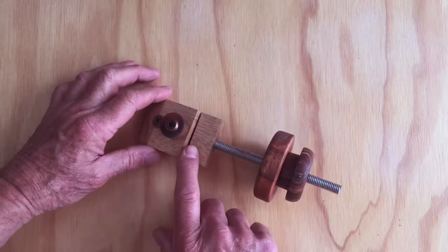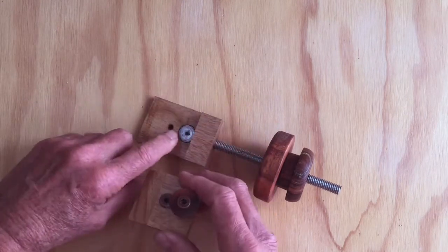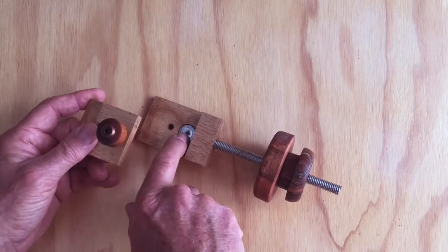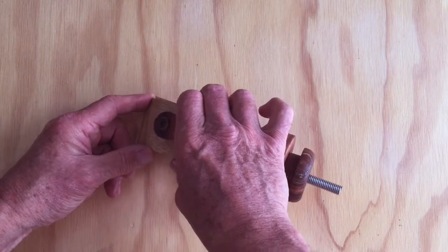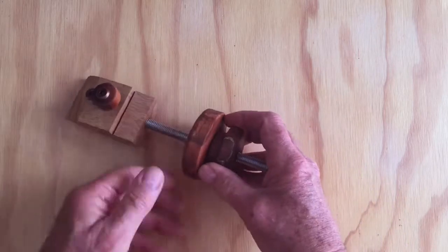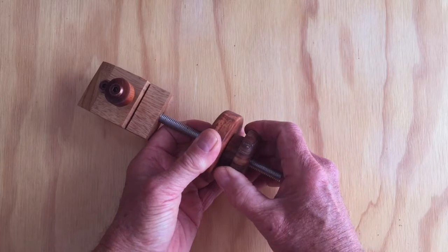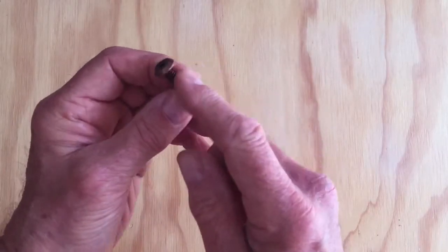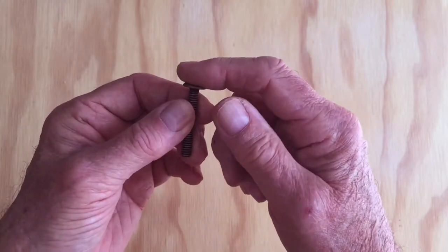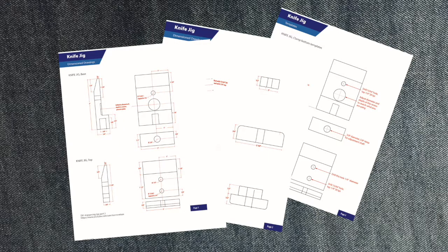Let's take a look at the jig. The jig has a clamp at the front that holds the knives. The clamp top has a quarter-inch hole where the front bolt goes through and then it's threaded into the bottom piece. The back hole is a threaded quarter-inch hole and that bolt pushes against a pressure plate to clamp the jig. It has a shaft on the back — an adjustment shaft — with an adjustment disc to move it closer or farther away from the sharpener, and a locking nut. There's a link in the description to free templates and measured drawings in both imperial and metric versions.